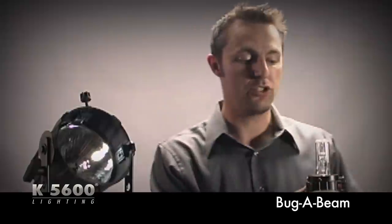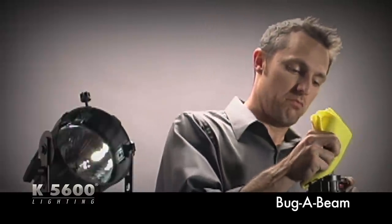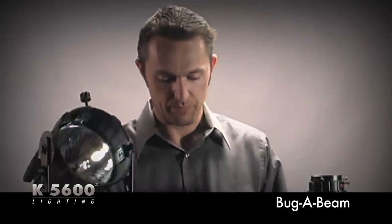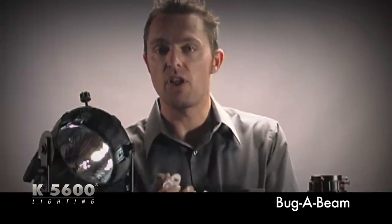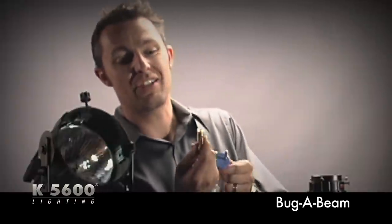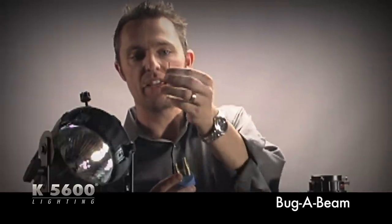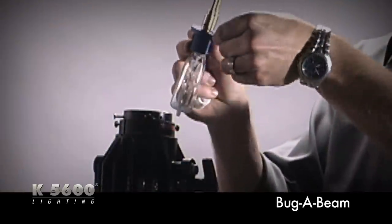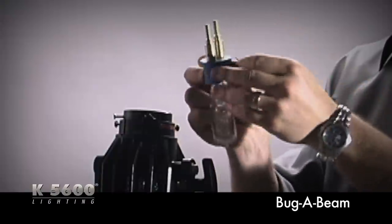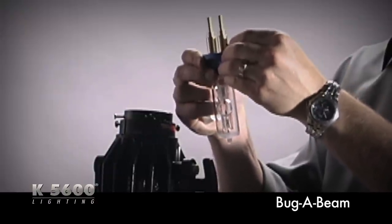Once you've got this piece, you're ready to adapt your 800-watt Joker Bug for the Source 4 fixture. First thing you're going to need to do is remove the globe — simply wiggle the globe out, it comes out of the socket base. What you're going to need is a couple of pin extenders, which come in a nice little bag. It comes with a Teflon retaining block, which helps with the arcing, and two brass extension pins. These have two set screws and slide onto the base of your 800-watt globe. Simply slide these on and take the included Allen key to tighten the retaining screws down. This ensures a nice connection between the ignition circuit inside your Joker Bug 800 and the globe itself, and enables the 800-watt globe to be within the appropriate light center of the Source 4 for a clean projection image.